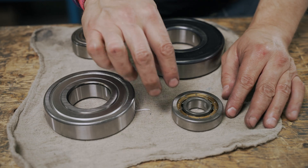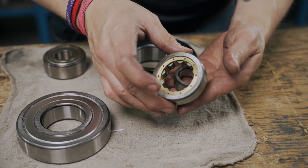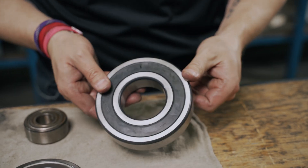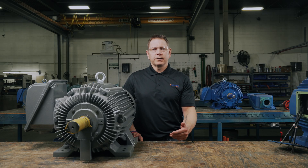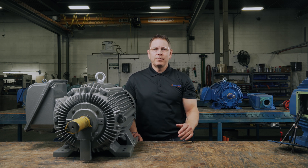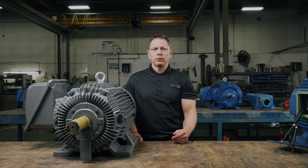There are five types of bearings. Rolling element bearings have balls or rollers that allow motors to run at high speeds with minimal power losses, often found in heavy-duty rotating equipment with high radial demand. Sealed or shielded bearings have additional protections for contaminated or wet environments, and are common in wash-down environments like food manufacturing plants. Sealed bearings keep contaminants out and retain the lubrication. Sleeve bearings are a simple design with a single rotating cylinder instead of rolling elements and function as a sliding action, but are not very common — you can find them in light load applications like bathroom fans.